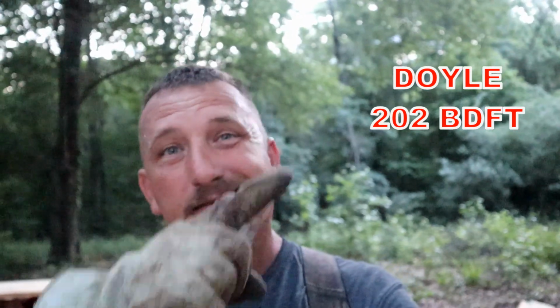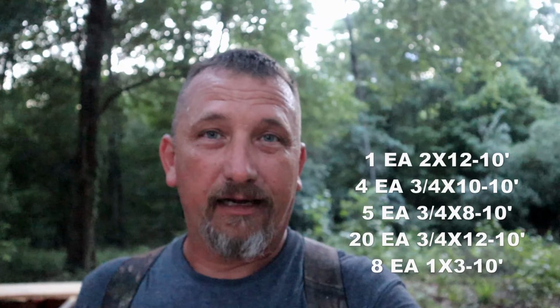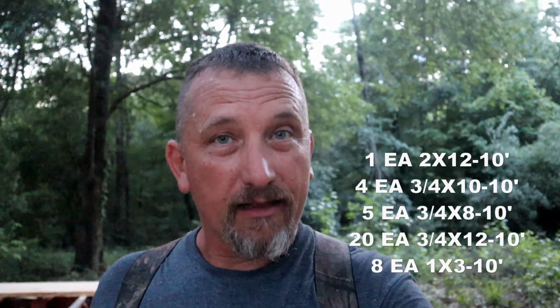Okay guys, now that we ended up getting that whole log knocked out, I'm going to show you exactly what the Doyle scale said that log was. Remember, it was 10 foot and about 22 inches on the small end. So I'll tell you right here what the Doyle scale said, and then right here is what we ended up yielding out of that log. Remember, we ended up getting some 3/4 by 12. I know I was going for 10, but I just said to heck with it, I can cover an extra 2 inches per board, so I'll just go with that.